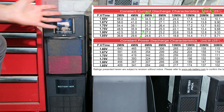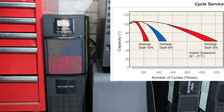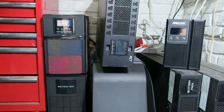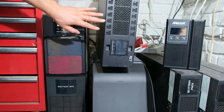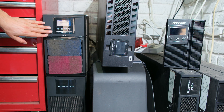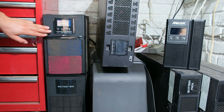When these UPSs are loaded quite high, battery life drops extensively and very quickly. If you buy this UPS and only load it up to around one kilowatt and hardly ever let the power go off - which is almost impossible in South Africa - then you'll get a fairly good battery life of maybe one and a half to two years, and that's in ideal situations where power almost never goes off. However, if your power goes off even 20 times and the battery declines and the UPS shuts off, your battery life is going to decrease considerably.